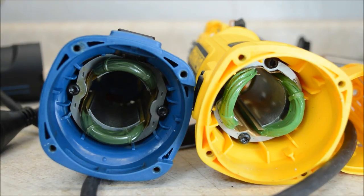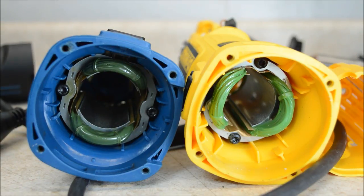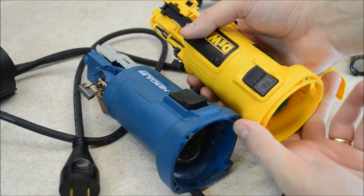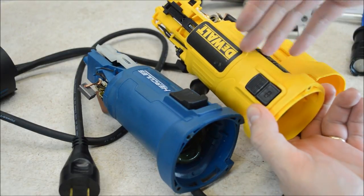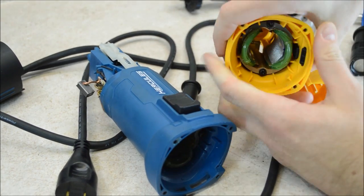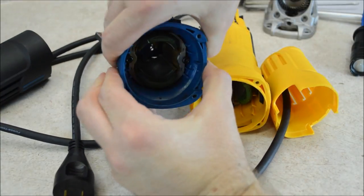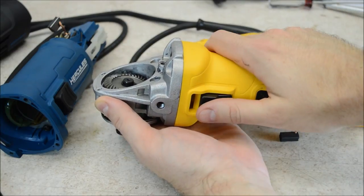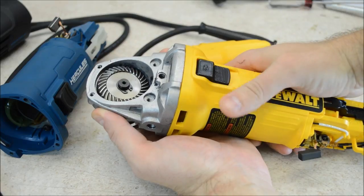If you like these videos, please share them on forums and social media, anywhere there are people who might like them. Now thinking about the motors — both of these claim to draw seven amps. The housings on both are made of PA6GF30, so that's nylon with 30% glass fibers. That's a totally normal material for this application. On both of these there's plenty of meat — they're both quite beefy housings and plenty stiff for this job. On both, it looks like you can rotate the housing to change the orientation of the switch, for example if you want it on top instead of on the side.